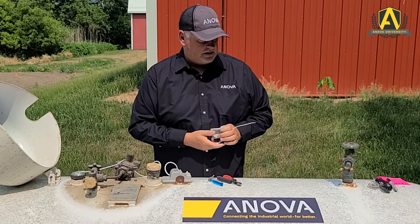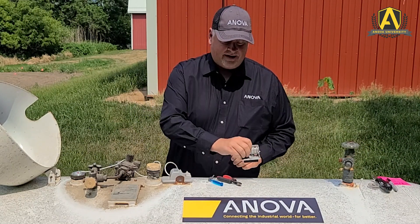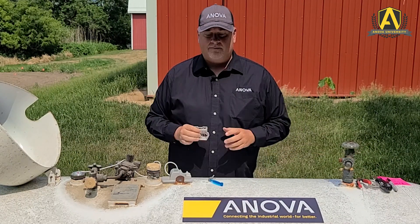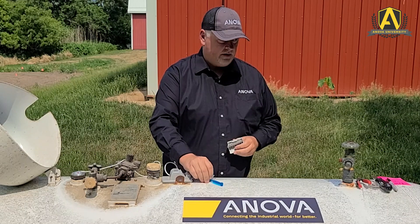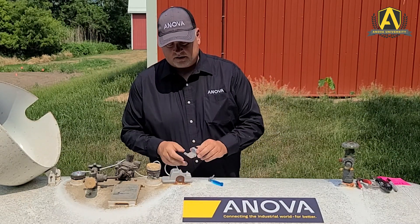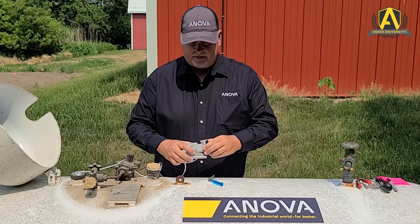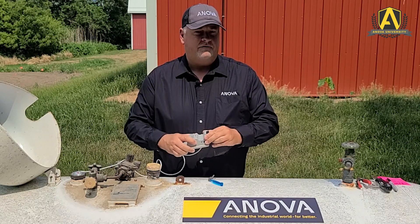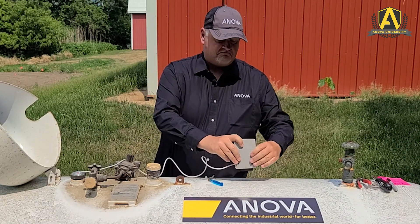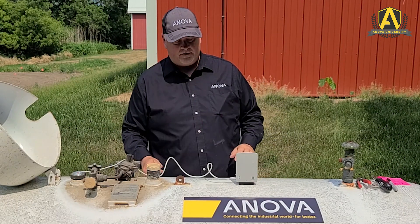In this case, we're not going to use the zip tie method. We're going to use the magnetic mount, which is an extremely strong magnet — you should have no problems with snow load, wind, or anything knocking the UTM off a tank. To install, click the top of the unit into place, rock it forward towards the bottom, and you're going to feel a click as a little lever in there locks the mounting bracket into place. Then you secure it to the tank.